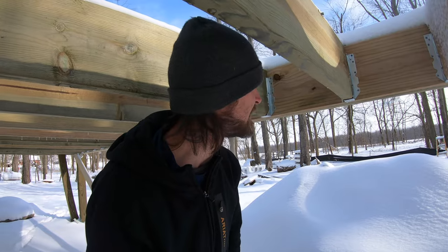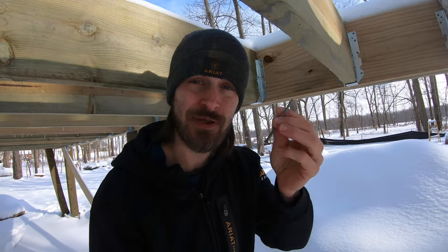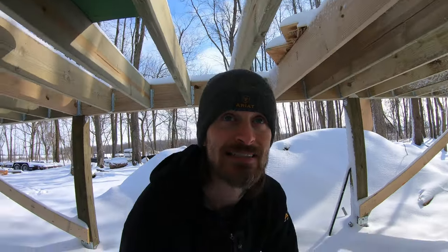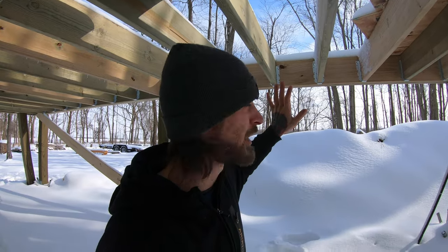So unfortunately, we have to remove every one of these 1.5-inch nails, get a 3-inch nail going in at an angle, so that way you help with the separation. I think it's kind of pointless, again, because you can't separate the beam from the house going that way, or push in any harder, and I doubt there's ever gonna be a force strong enough to push away, but I think we would fail inspection if they found out, hey, that nail is supposed to go at an angle, it is supposed to go into the front and back beam, and if they remove one and see that it's only 1.5-inch, they're gonna fail me, so why not just take care of it right now?